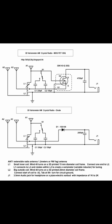Then to pair it up, we have a fixed capacitor, actually two of them, C1 and C2, because the variometer's range cannot cover the full spectrum, so we need to have two different size fixed capacitors to tune to the low band or the high band of the AM broadcast station. So C1 is 330 pF for the low band, C2 is around 150 pF for the high band.